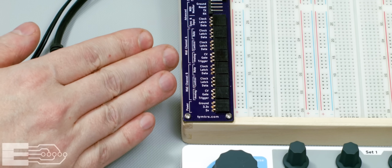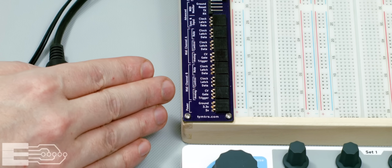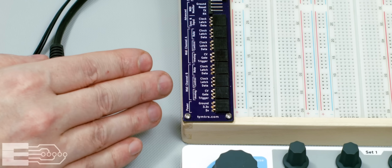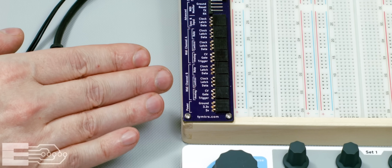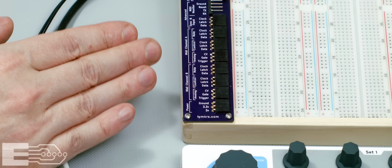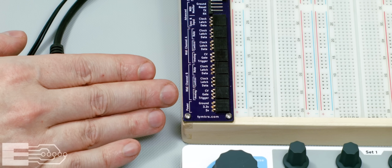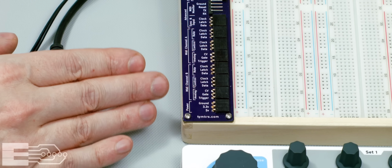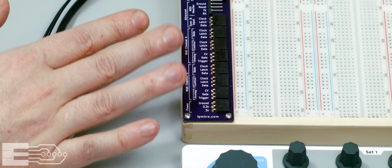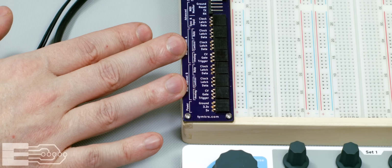So we've completely covered everything on MIDI channel A. And all of the same exact things are on MIDI channel B. Just in case you didn't have enough. So we don't need to recover all that ground. Just know that up on the dip switch, you can set MIDI channel A to be any of the 16 MIDI channels, and you can set MIDI channel B to be the same number or a different number channel. So they could both be copying each other, which could be useful, or they could be set to different channels and be doing completely separate things. It's like a stereo effect.